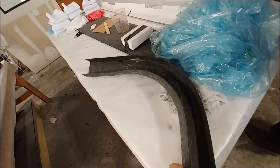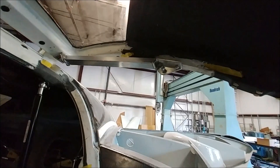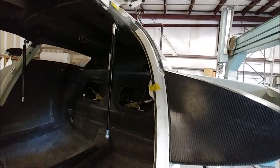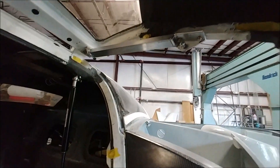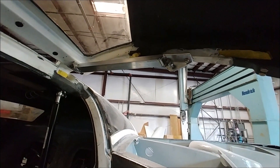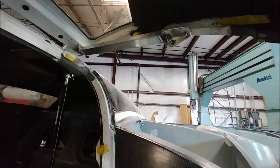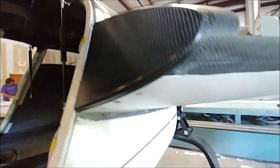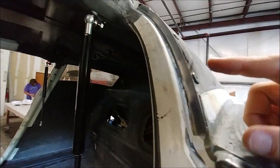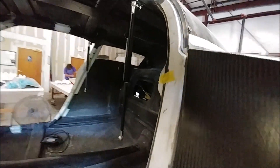The job was to do two of them on Friday. There's one of those closeouts here now, pretty much trimmed and sanded down and ready to be bonded into place — I think you'll see that happening next week. I pretty much spent all of Thursday fighting with this door. It turns out that even though that bracket is doing the job it's designed to do and allowing the door to close, it was still pushing a little bit on the door and forcing it to bulge out right at the bottom where the window is.